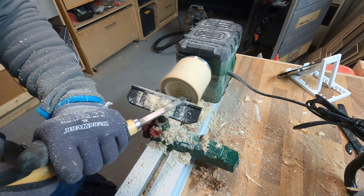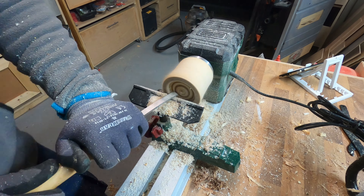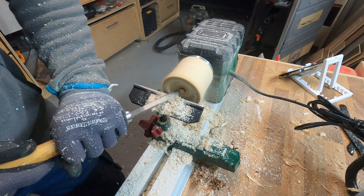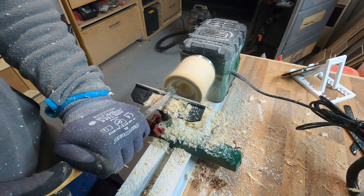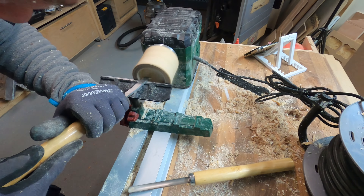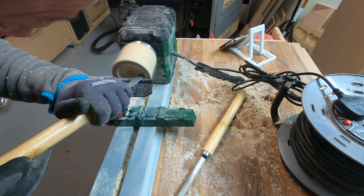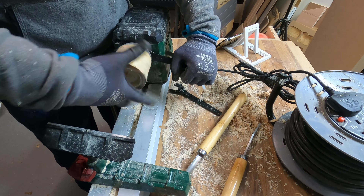The only times I got kickbacks was when I came through the middle — there's what I can only describe as a nipple in the middle of the wood. I was very conscious that on the side I wanted to leave about a 10mm gap, so I just started taking it more and more. You can see from the amount of wood cast off that I was really going for it. I then reverted back to my original tool and, because I'd gouged out the middle, it was taking the wood out really nicely. I loosened it off, had a look, and was pleased with how it had worked out.